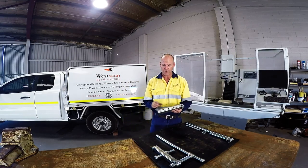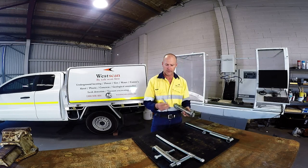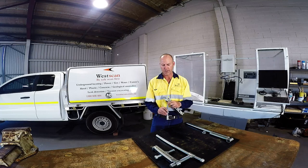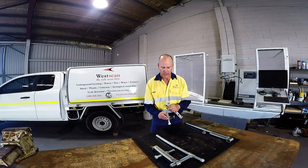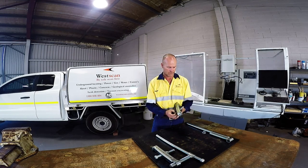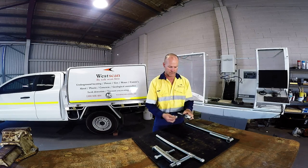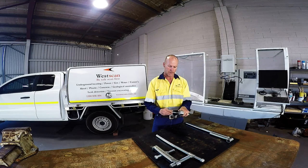We've got our load bar with three holes on it. They're just adjustment holes for the different sizes and different slots and lids. Our T-bolt — the top of the T-bolt has a tongue in it, and that T-bolt tongue is lined up with the bottom one. So as you put it into a slot and you turn it, you can actually see the orientation of the bottom. I'm going to put on a washer and a nut just to secure those in place.